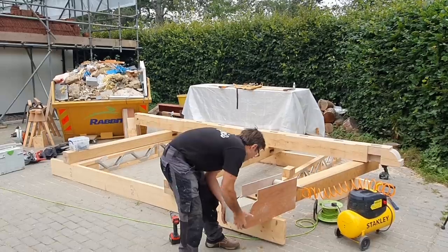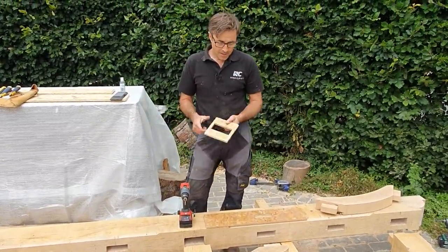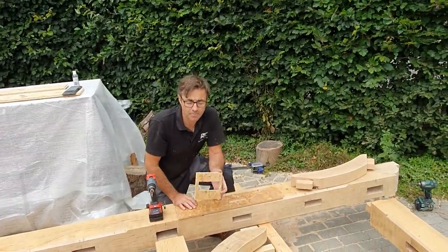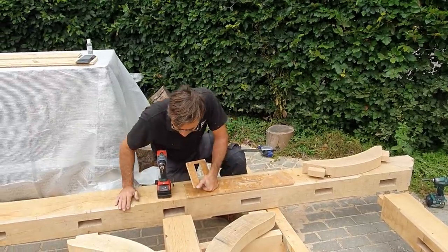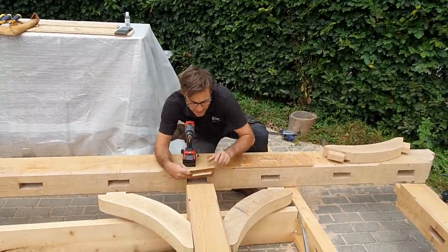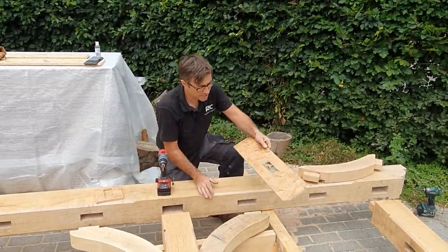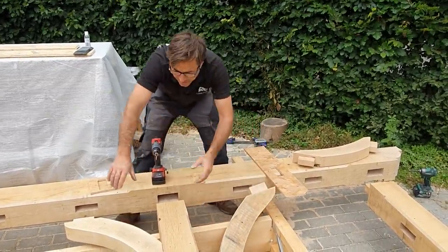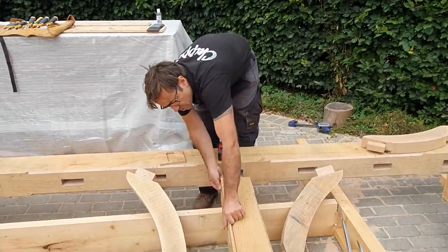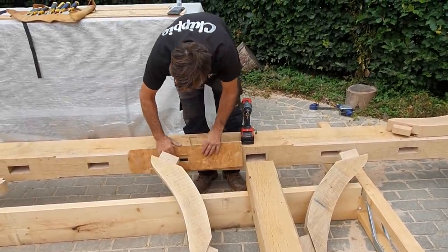During the course of this frame I made some very simple templates. That was my main tenon and mortise template for the top of the post and the head beam — that represents the post, with a mark for the face side, always working from the face side, marking the tenon and also the mortise. Then we've got one for the braces — where we've got a brace, again off the face side from the shoulder, that is my mortise template, and reversed round from the shoulder of the post it's also my mortise template.